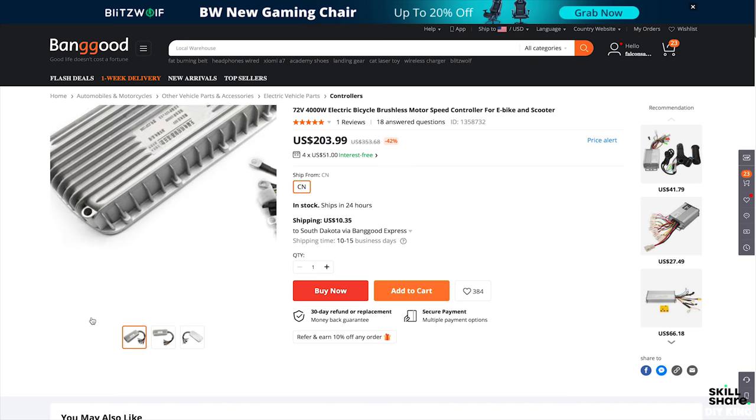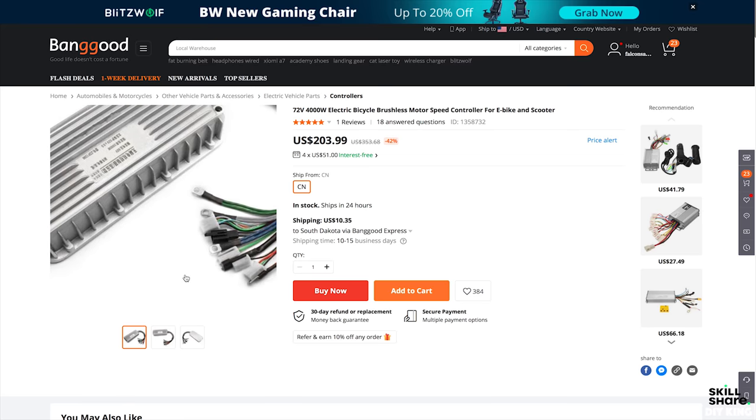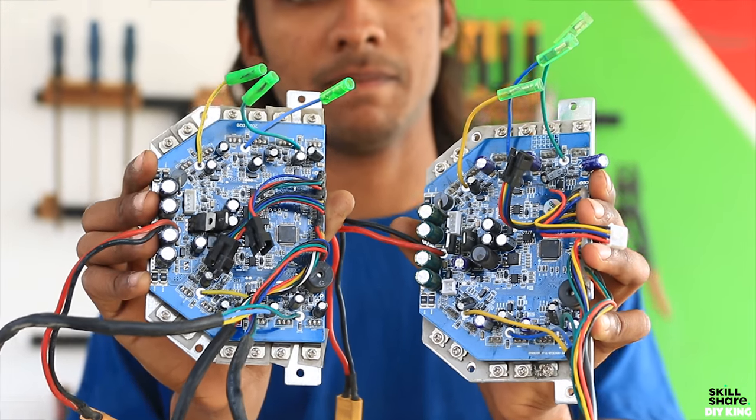With that being done, we are a step away from driving our go-kart, for which we are going to need 4 brushless motor speed controllers. Now, we would either end up spending the budget of our next DIY project on readily available speed controllers, or we could just modify the stock firmware of the hoverboard speed controller to get the job done.